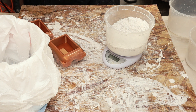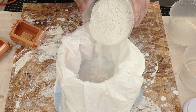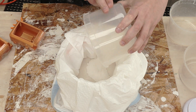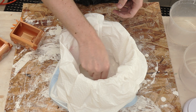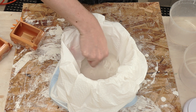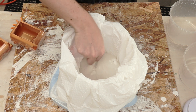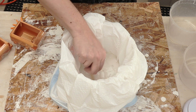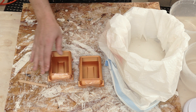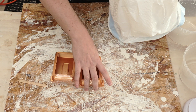I'm going to take this and dump it in my garbage-bag-lined bucket. Now I want approximately the same amount by mass of plaster. I've got my respirator - I'll go ahead and put that on and we'll do the plaster. All right, my water's in here, I'm just going to slowly pour in the plaster. All right, that is all of the dust, so I'll take off my mask and mix this up. I'm also making sure to use cold water - that definitely slows down the reaction process. This mix is much runnier than I've used in the past, which I think is a good thing - it may be part of my bubble problem. I'll just let that slake for a couple minutes. This is definitely on the runny side compared to what I'm used to, but let's try it out. That's the other reason I'm using some very small molds.